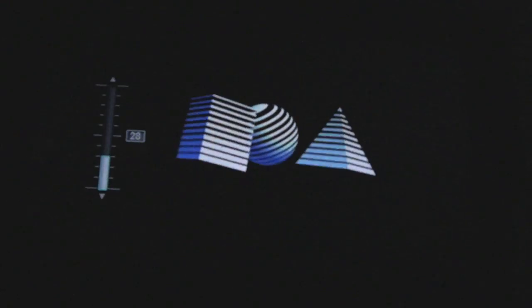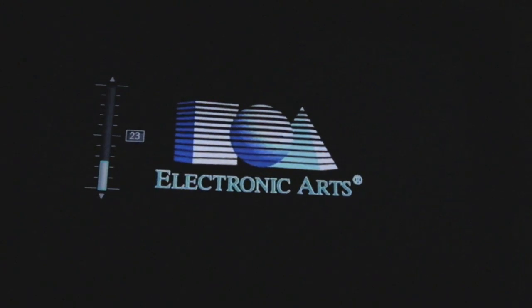I perhaps didn't explain very well at the start of this video what the actual fault was. Once it had warmed up, it was struggling to read original pressed media. That was what got me thinking about that cap, because I did remember seeing that corrosion previously and just didn't do anything about it at the time. I checked the cap and it looked okay, but I didn't realise it was causing the read problems. But also, as I described, I did have to adjust the laser voltage a little bit as well, and I think I've reduced it. Thanks for watching — I'll see you soon.